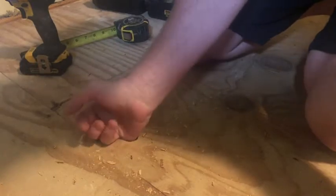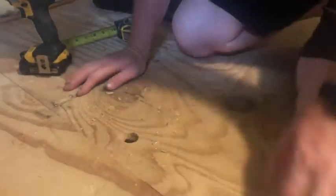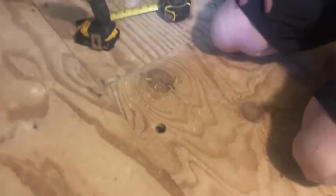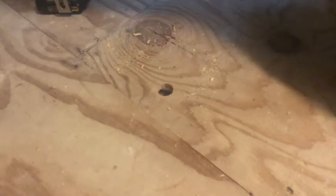Okay, yeah, that's the problem, man. All right, so here's the problem. The reason that they're having a little sagging here, you can look in this crack, it's not tongue and groove, so it's not locking together. Actually, this is a fairly easy fix. We can just put a couple 2x4s across here underneath, put that patch right back in there, and she should be good to go, because this little plug isn't going to hurt anything missing here. We can take care of that.